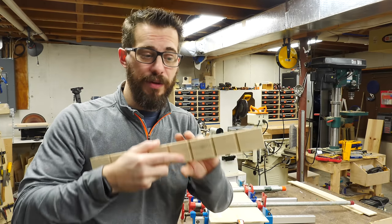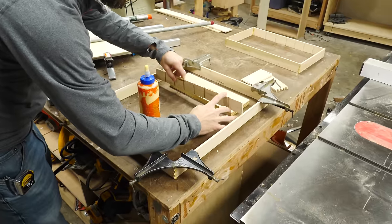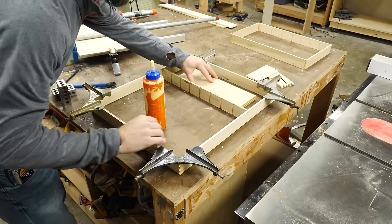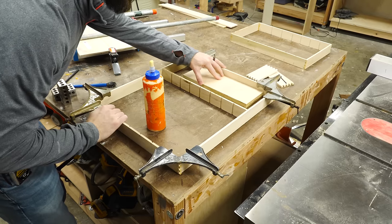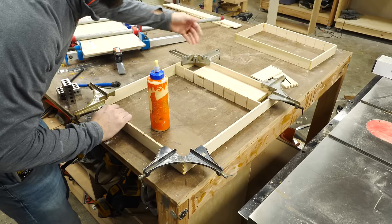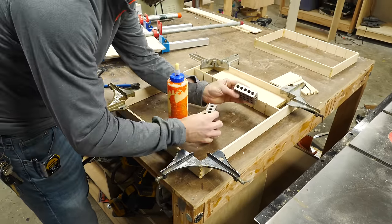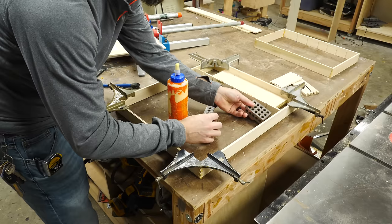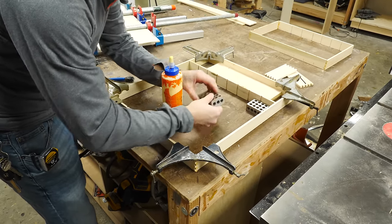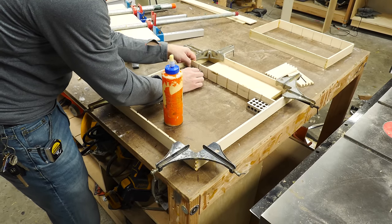I've got the outer box glued together. Now I've got to put in this internal divider — it's just going to sit in between the two outside pieces. I forgot to put in a dado for it, but it'll be glued and should be all right. We're going to put a spacer piece all the way against the back wall and then slide this divider against that spacer to make sure it's the same distance from the corners. I've also got these 1-2-3 blocks, which are really handy — they're a good way to hold things in position because of their weight and squareness, and that will keep those pieces square to the outside edges while the glue dries.